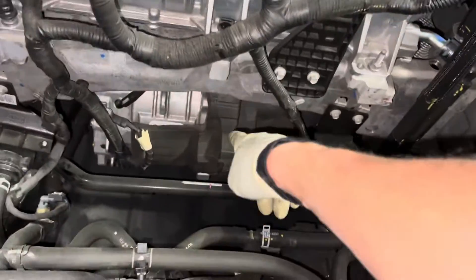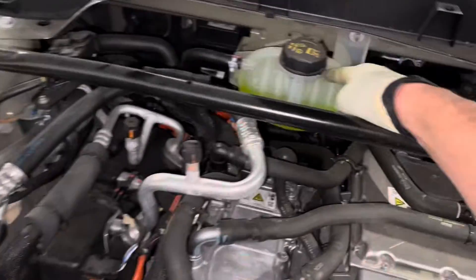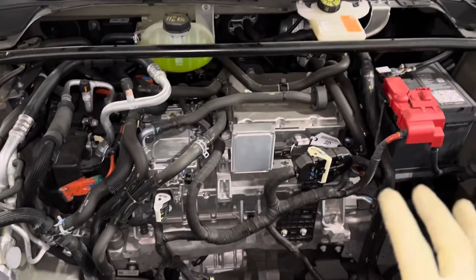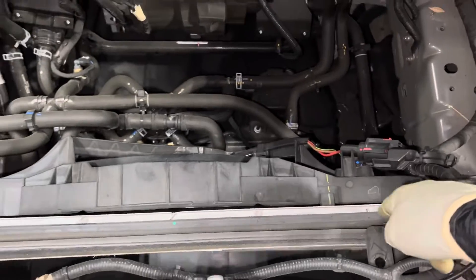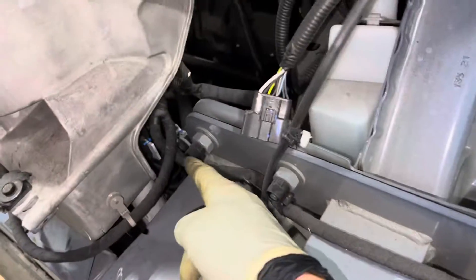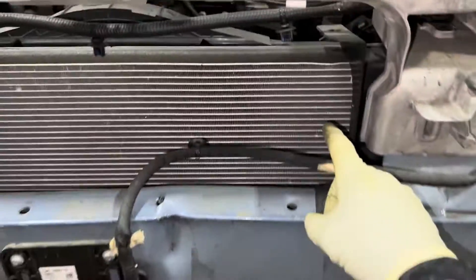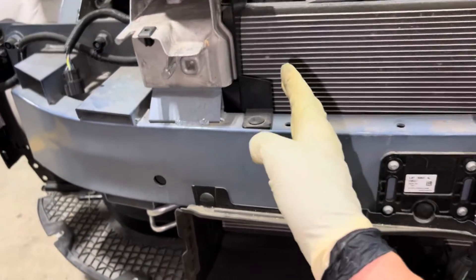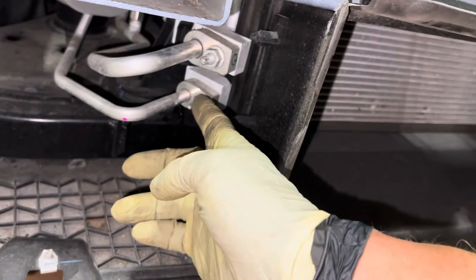That's going off into the inverter and motor assembly — the motor is down there, the inverter is up here. Everything is taking care of by glycol. They have two separate glycol units on here, and remember, this is an all-electric vehicle — there is no glycol for an engine. Here's our glycol heat exchanger up front — what most people would call a radiator, but that's your glycol plate heat exchanger. And here is your condenser — they still have a standard condenser. High pressure refrigerant goes in at the top and sub-cooled liquid comes out of the bottom.